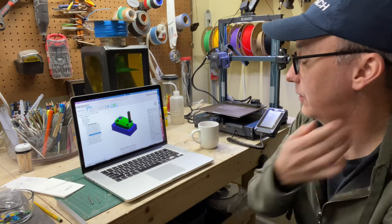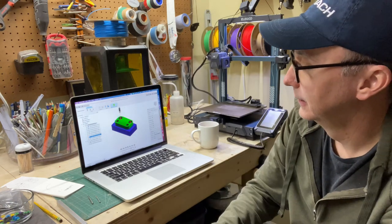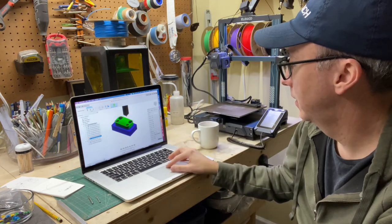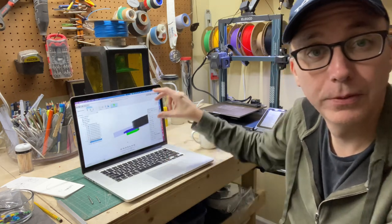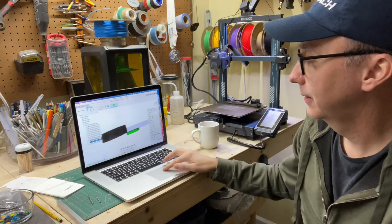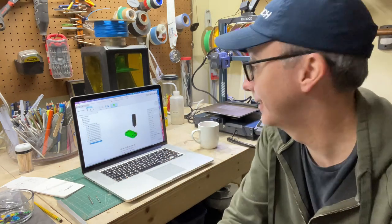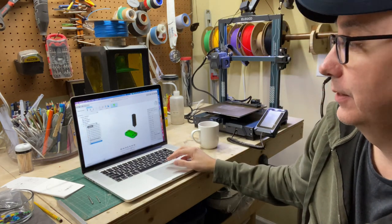Then there is the pocket, and then the inner pocket, and then the chamfer. Then we'll flip it over, use the face mill to cut away all the remaining stock, and come around and chamfer the backside, and that's it. Total machining time, being very conservative, is about 6 minutes. So it'll take me longer to get the tools set.